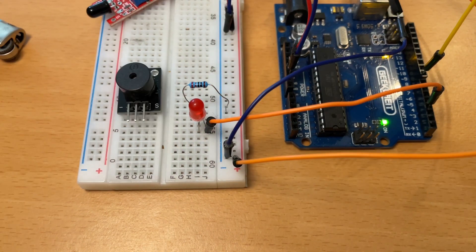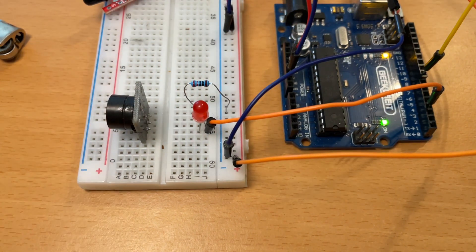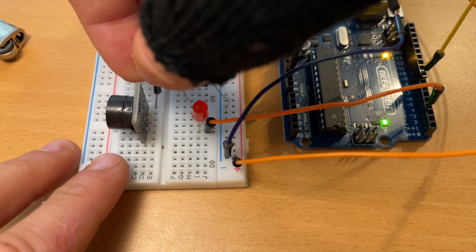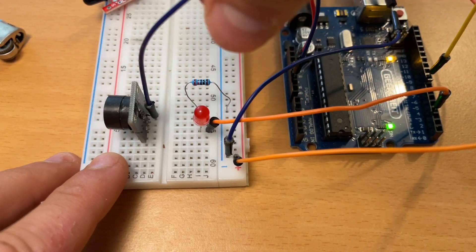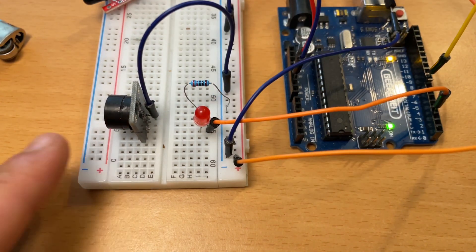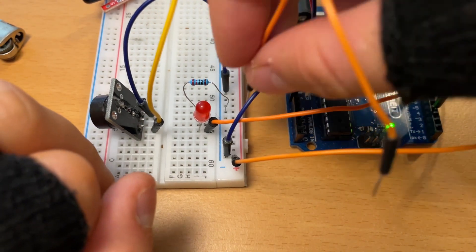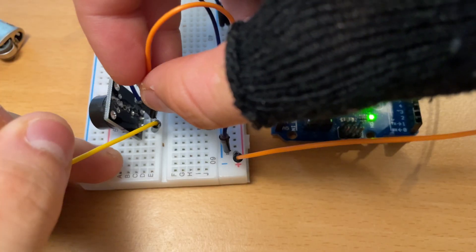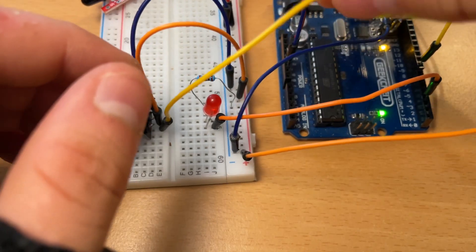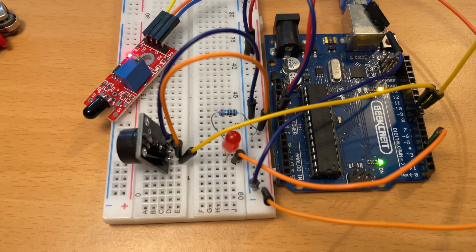I think this is a pretty cool project. Now, if you want to make a flame alarm, all we need to add is a buzzer. We're going to take a buzzer, connect it to the protoboard — on the top we have a minus pin, on the bottom we have a signal pin. We'll take a blue wire and connect it to the same row as the top pin, then connect the other end to the blue row of the protoboard. We'll also take a yellow wire connected to the same row as the bottom pin of the buzzer, and an orange wire connected to the red row of the protoboard and to the same row as the middle pin of the buzzer. Finally, take the yellow wire and connect it to pin 9 on the Arduino Uno.